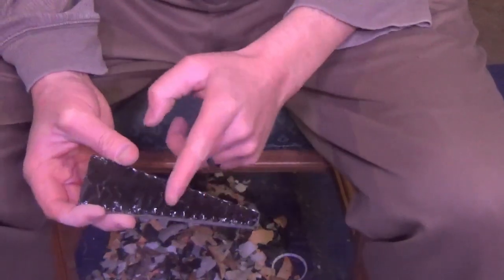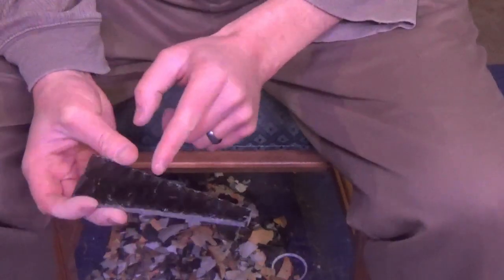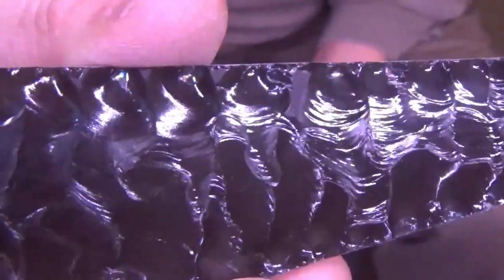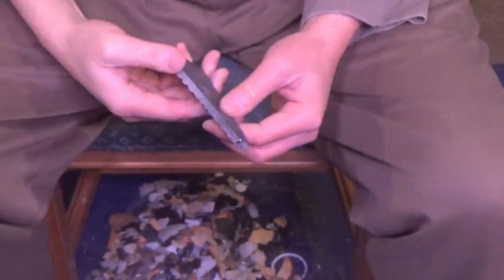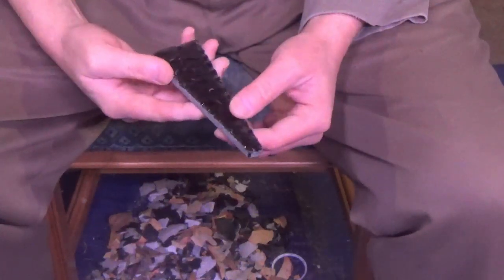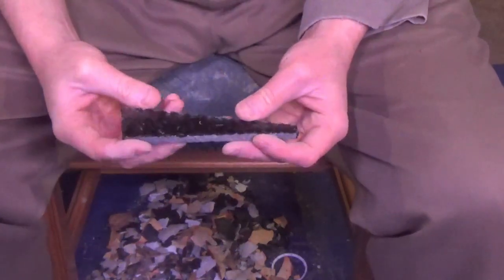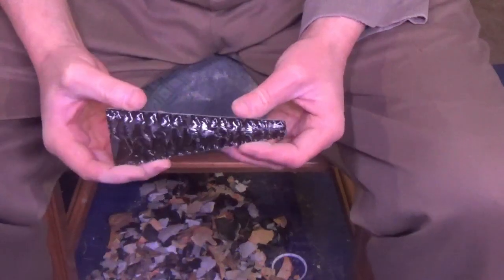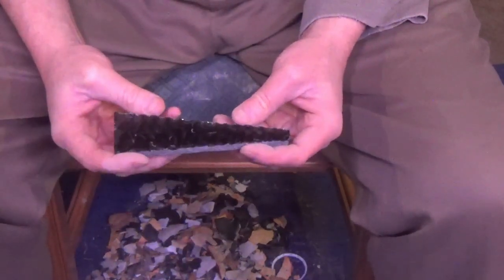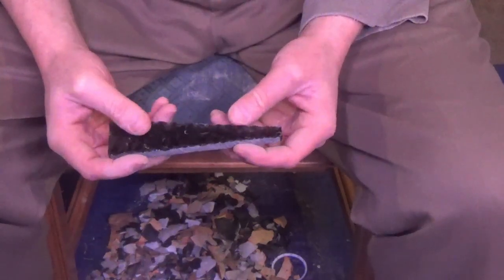But when you stagger those, even if you stagger them and you're getting things like this, yeah, see that where it didn't remove the saw marks? That's okay, because if you're just barely skinning the surface just to start your initial pass, you'll be able to fix that without any issue at all. And that will also prevent those steep flakes on that second pass.